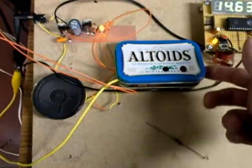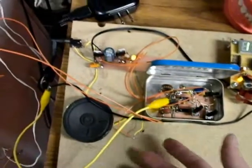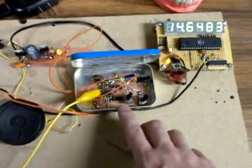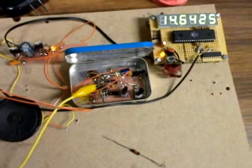Here's the 14 MHz receiver. It's hooked up in receiver mode — we've got a speaker and it's going to the antenna. I believe the quality of the oscillator isn't very good right now; it's a very low Q, so the audio is really, really bad. But at least it gives us something to start working with.